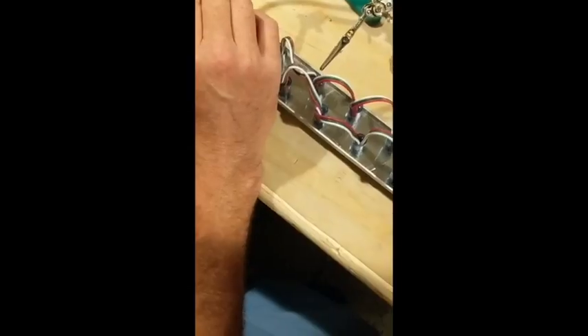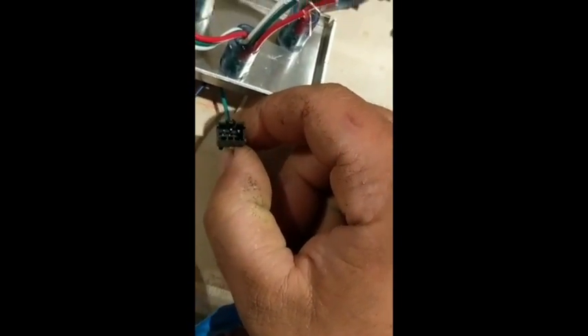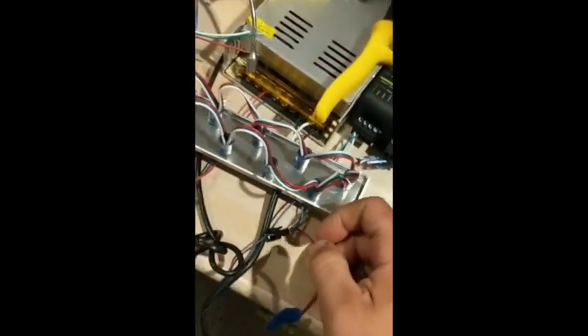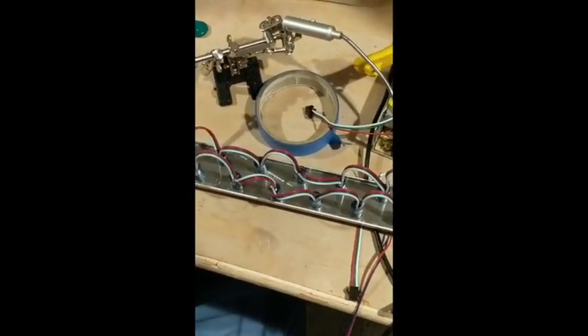The code Jay uses for the connectors: you can see a little connector here. This is the input side — here's a male connector, which is on our input side. And here's a female connector, which is our output side. When we get all of those lining up correctly, there's no way to mess it up. This is a 12 by 2, or 24 LED pixel box.